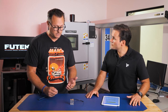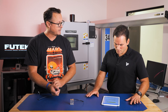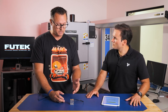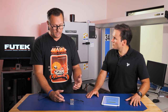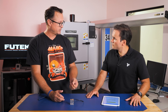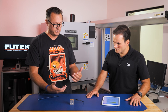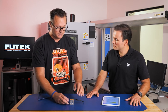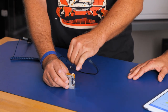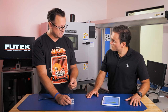Yeah, so one of the things that we were looking at, again, being an OEM-based sensor that we want to integrate into the customer's product, is the cable attachment. It can get somewhat complicated with the soldering of the direct cable into the part, or they would have to go to a crimping. Crimping has its own IPC 620 requirements, and can be complicated for certain companies to implement. So that's where we came up with the JST. It's an 8-position connector. Four of them are for the sensor main bridge, 2 of them are for the TEDS, 2 of them are for the PT1000.